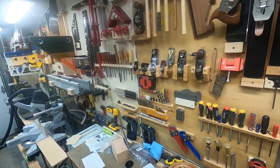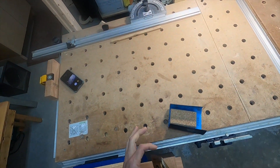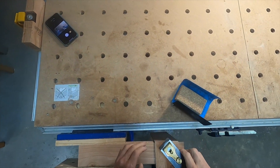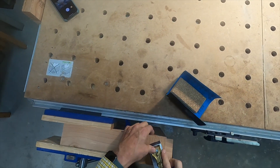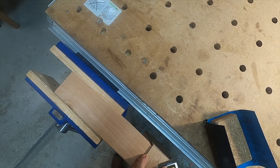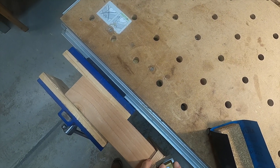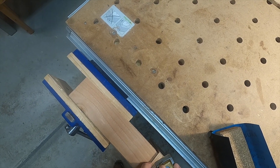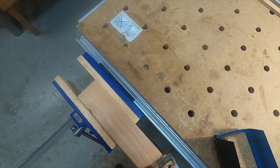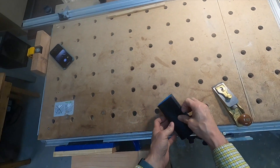What I'm going to try to do is use a chisel plane. A chisel plane is an interesting plane - the blade edge is all the way up on the front edge of this thing. You set it so that the edge touches whatever you're working on, and you can just lay it flat. It's great for cutting off the excess. You can see how I'm moving it, scraping it in and cutting the edge all the way down so that it's even with the other piece - without sanding. I think I've done that all the way down, so now I can go back to my sandpaper.